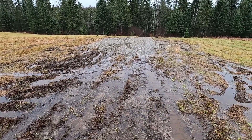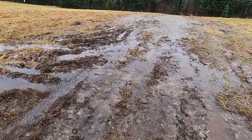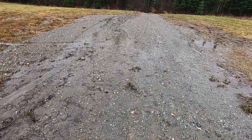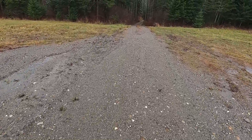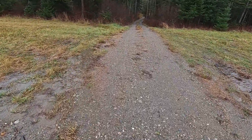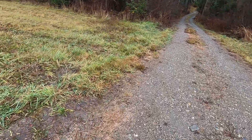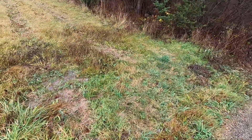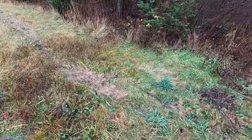Here's an area where the field ends and goes into the woods. You can see some surface water running here. I did build up the center of the road a bit to force the water off to the left or the right — it had been channeling down the road. You can see now that it's not happening. I've made a little bit of a swale on the left, and that's working well.